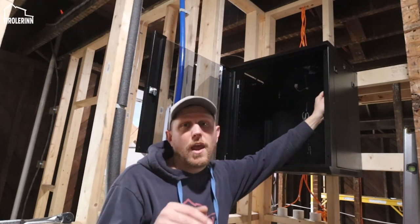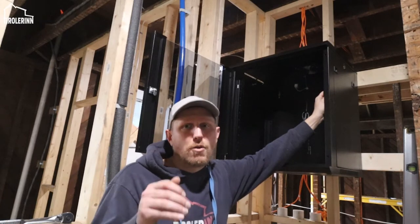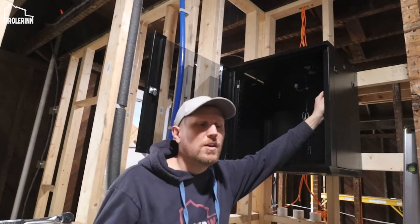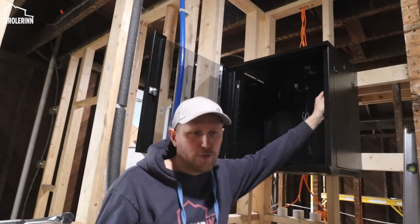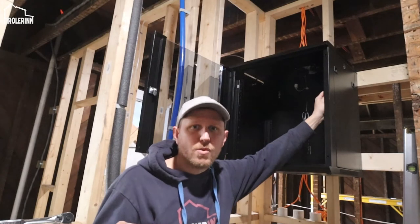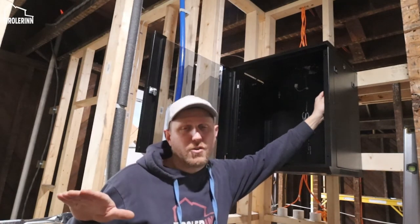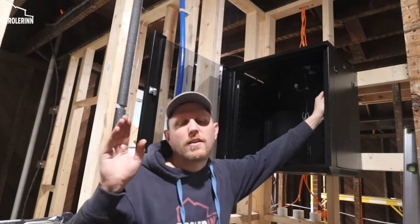add wire later, and you cannot guarantee when you open walls later on that you might not run across existing electrical wires. So then you want to just follow the rules again with staying 8 inches away from parallel runs and not touching wires that you're crossing. So rather do it beforehand, add more, then you don't have a hassle and headache later.